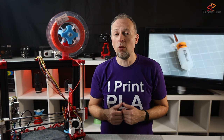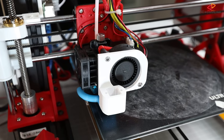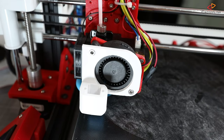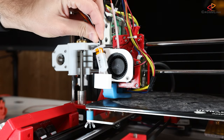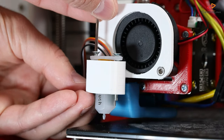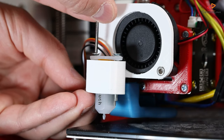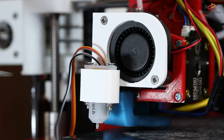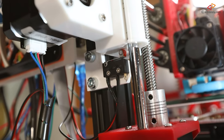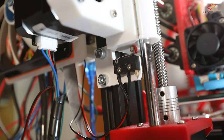The first consideration when installing the BLtouch is where to mount it. I've chosen to mount it to the front of my Hemera Extrusion System, but depending on the printer model you are using, there might be different mounting options available. This is a modified version of my existing Anet A8 BLtouch mount, also linked in the description, together with some other alternatives. A little tip: before you start with your modification, still leave your old Z-level switch connected and mounted until we reach the end of this guide.